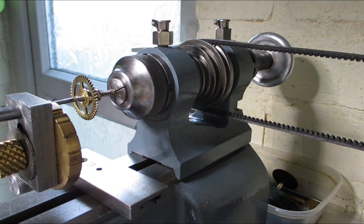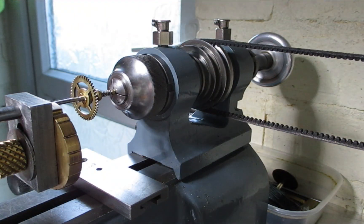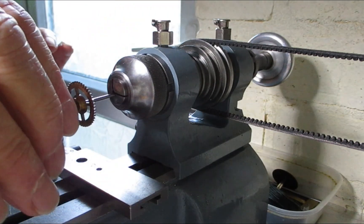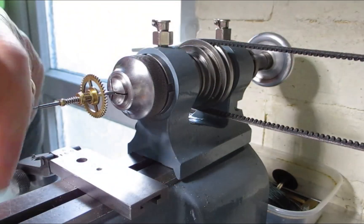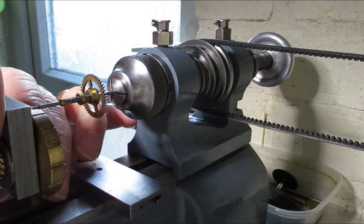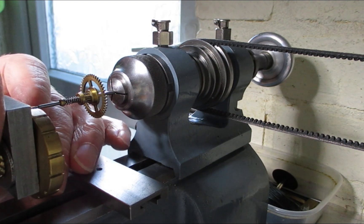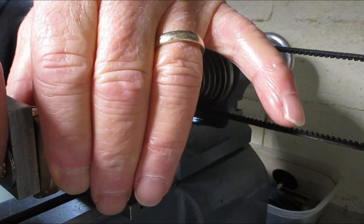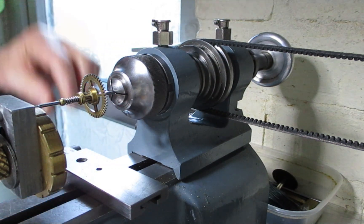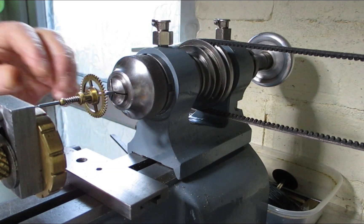That's all I do. I'm going to clean the oil off and then I'll put it in a collet the other way round. Then you adjust this to suit — you want it just protruding above the slot like that. And then again you do it over there; that way it supports the end of the pivot.